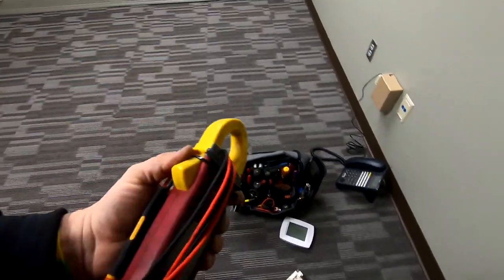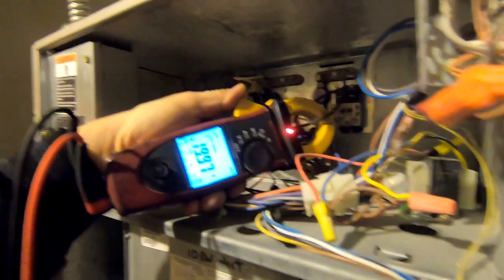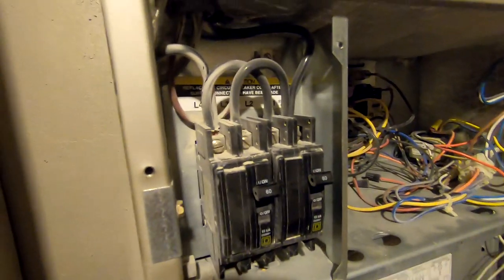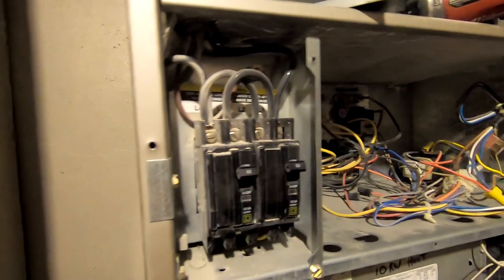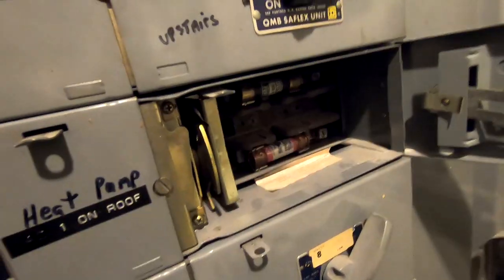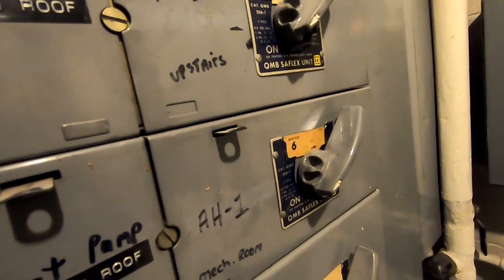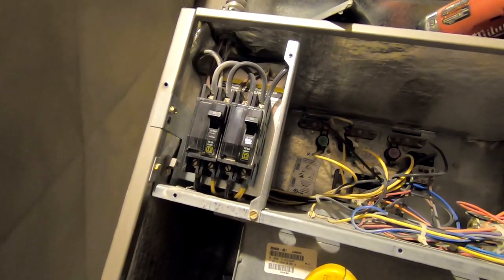About the time you don't check, that's when you'll be coming back. Checking that first element — 21 amps. Jumping over to the second one — 21 amps. Total amp draw is 45 amps. They've doubled the breakers up to feed both, and they've probably unhooked one element to justify it — obviously there's a reason they've done that. Going up and over to the air handler, checking the fuses — they're 60s. Running 20 amps per leg, really about 21, you're over. It's not capable of doing all three, which is why they unhooked one and we're just running two. Can't overdo what your wire is rated for. Tightened up all my lugs — they tend to loosen over time.